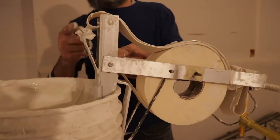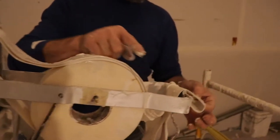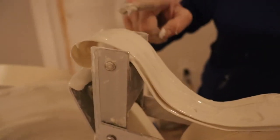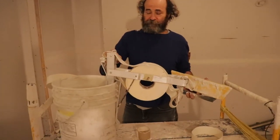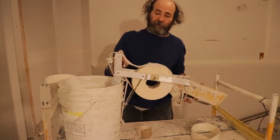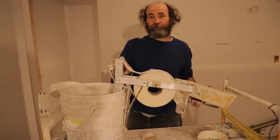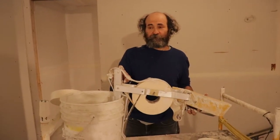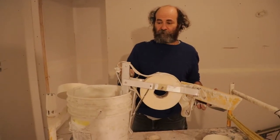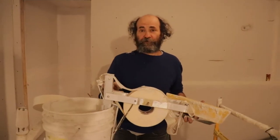Just go inside, around it, go in the mud, and just come out nice like this one. See the amount of mud, guys? This is a good amount of mud. The benefit of using this, if it is on a new construction, is that it makes a little bit of mess, but makes the job much faster. You can get one floor taped very fast. And this is good stuff. It is not very expensive and is easy to clean.